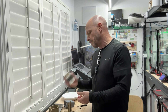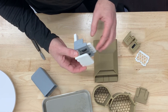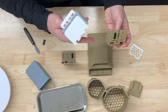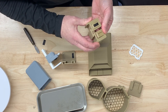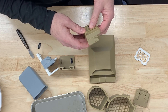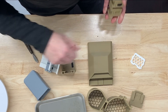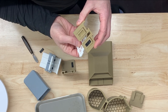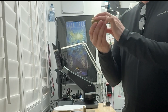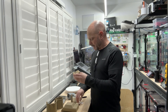I've made this in PLA and I quite like it in PLA. PETG would work quite well too — basically any material would be fine, with the caveat of these black little insets. Once disassembled, this gray part is the main body, and these are the compliant pieces that flex up. As you know, PLA isn't great for springs because it will just stay wherever you flex it to, but that's okay in this case.